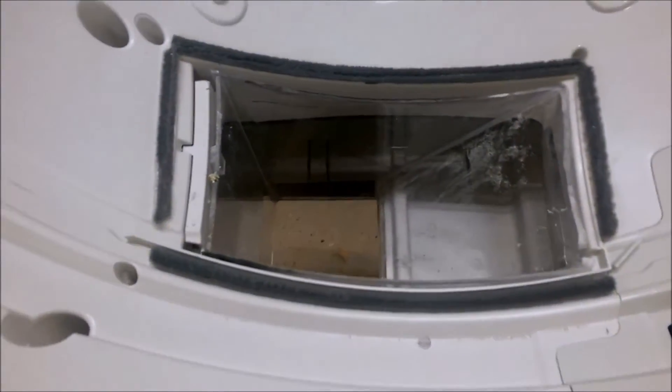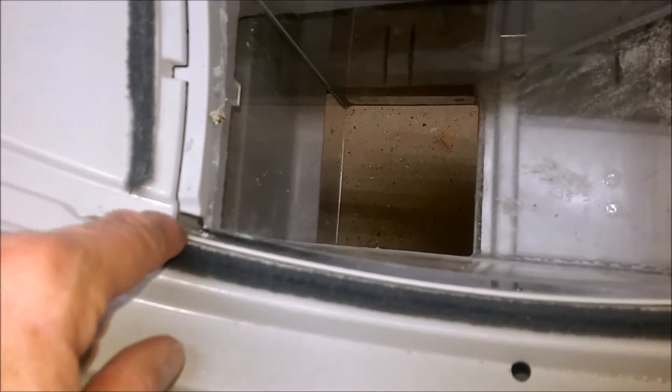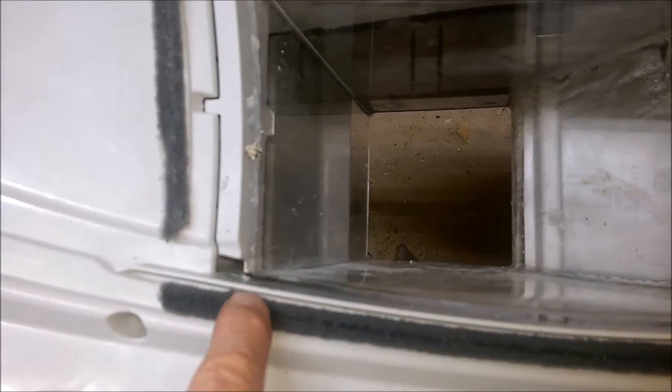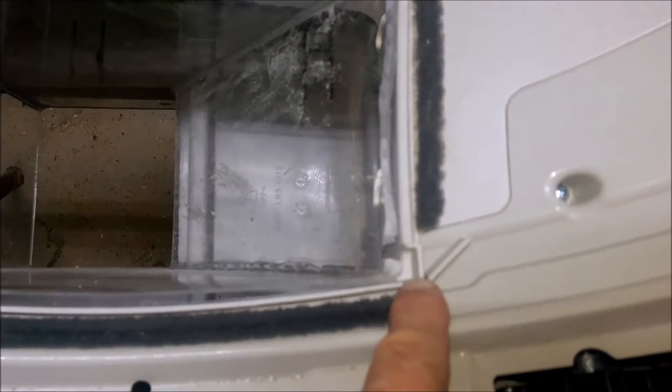On the top, the opening — I had to leave a gap along here because there's a tab on the globe that runs along this edge. Initially I had a problem with the tab getting hung up on this corner, so I had to sand it down. The tab is an emergency stop; normally it only goes about this far, but if it goes too far it stops against here and causes an error, so I had to make sure that slot is clear.